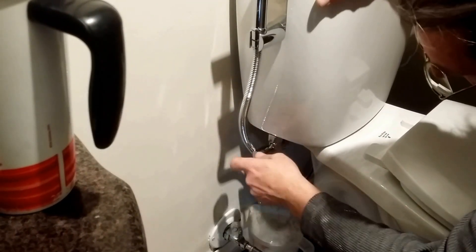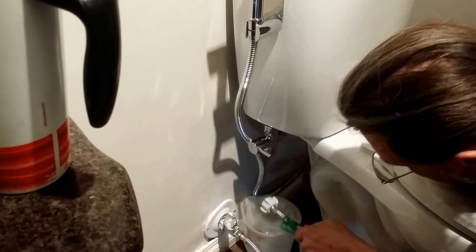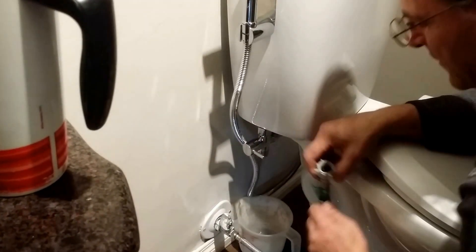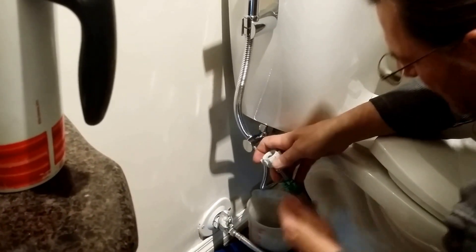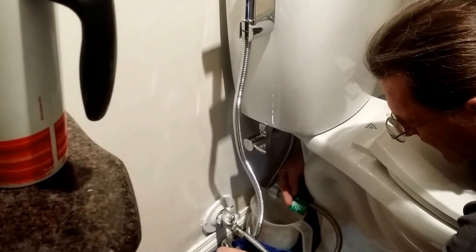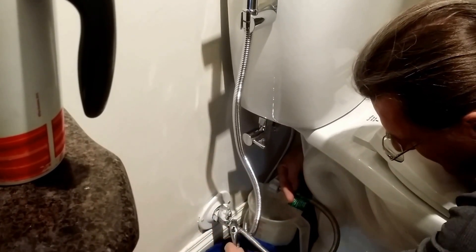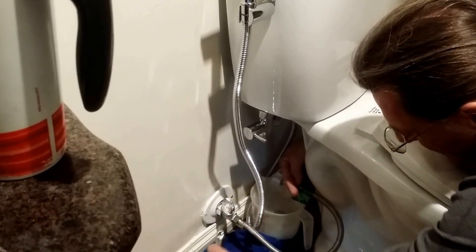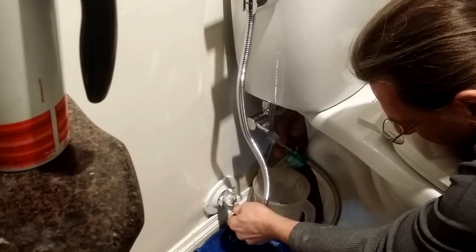This is connected and the water is off there, but we don't like this one — this one's dripping. The valve is dripping. Don't ask me why, on a new bathroom, the valve would be dripping. We have a shorter one since the length is shortened anyway, so we're going to take this compression nut off, which for some crazy reason somebody has put Teflon thread on, even though it doesn't actually help because that's not the active sealing surface.